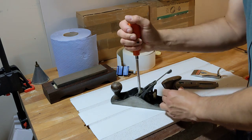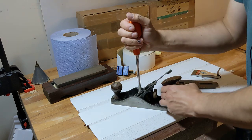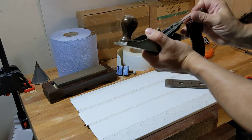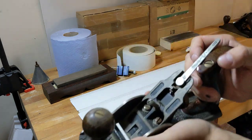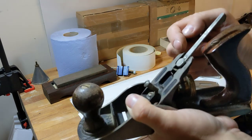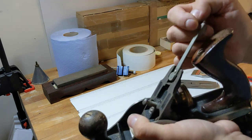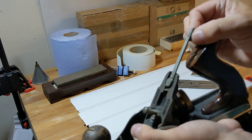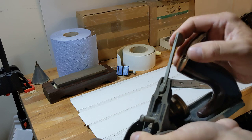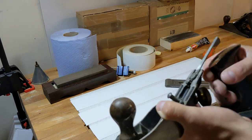Now, especially if a plane looks this clean, I'm not even going to go looking for problems. A lot of people assume there's going to be problems. They think they can make a better job of it, but they can't. Here's another reason why I like this age of Stanley planes: on a lot of the modern planes, this is like a fabricated piece, whereas this piece is done all in one hit. And the fabricated ones have a couple of screws that go into a brass adjuster or a brass tab, and I've seen them getting loose. But there's no way that's going to get loose, because that's all one solid piece, and I think that's excellent. That's a real plus point.